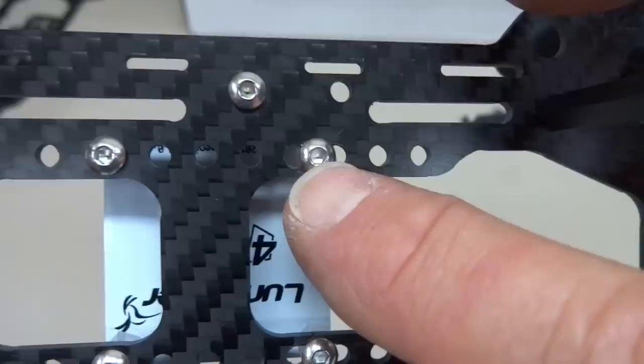I'm going to orient my pins so that my ESCs can plug in from the rear. They're going to be well protected. And the only pin up in the front is going to be for my receiver. And I'll orient the pins pointing backwards so that nothing sticks past the edge of this board. So I think that's the ideal way to do that. And it leaves our port easily accessible from the other side of the aircraft. So let's go ahead and do that.